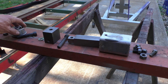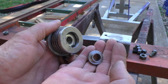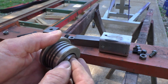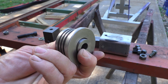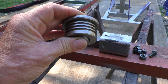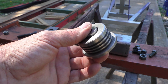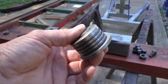Here's what I've got for our guide system. These are blade guides that I got from Cook Saw. It's got these spacers that go in here so that it can rotate on the bearings. These are hardened rollers. You will see some out there being advertised that are made out of 1018 steel, which is cold roll low carbon steel, and although they might look like a roller they're not going to last very long. These are hardened — you try to rub a file up against them and it just skates over without taking off any metal.